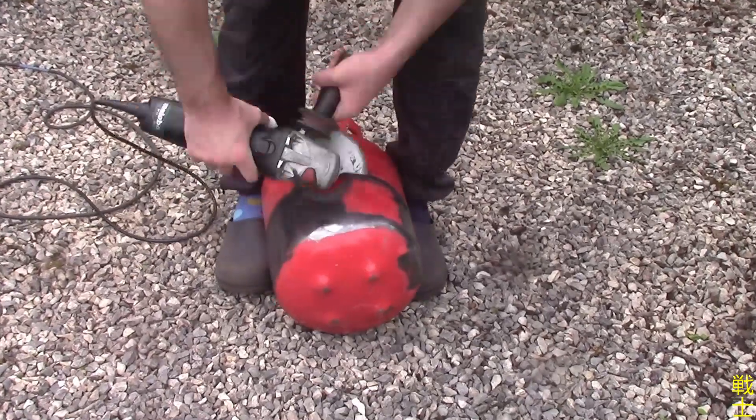For the hole for the burner, I drill a pilot hole and then widen it so the burner fits through. With the pilot hole drilled, I mark out the full hole and start cutting it out. It is not really important how it looks — the only important thing is to fit as closely to the burner as possible so as little heat is escaping. With the burner fitting, I recycle the holder for the burner from my old forge as well. I clean it up a bit and fit it to the curve of the tank. This is the pipe the burner fits through, with three threaded holes for screws added, which will hold the burner.